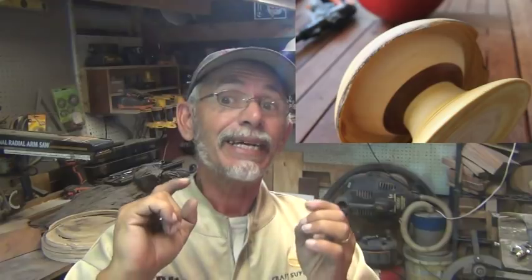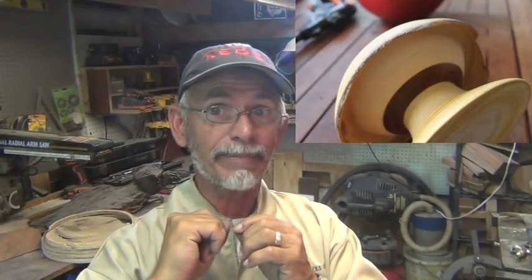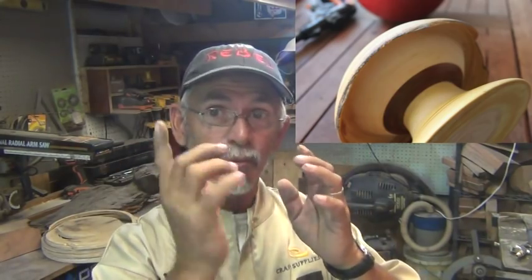Now, needless to say, I've done a couple of pieces out of this wood, and the second piece I did held absolutely true. No checking. It's been over a month. The thing is dry. On the other hand, the one I did from end grain turning that I did the repair, well, that thing still kept on checking away so bad that the ring I put on the bottom actually is kind of twisted up on it. The wood forced its way to get cockeyed. So, yes, the orientation makes all the difference in the world on what you turn.